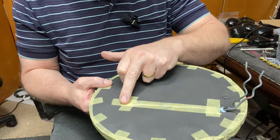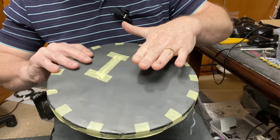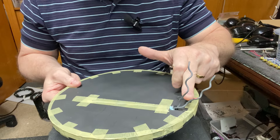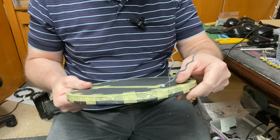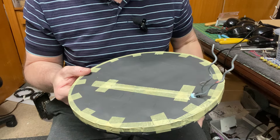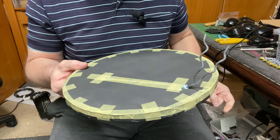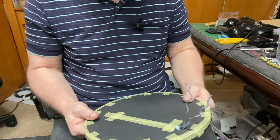Under the tape here is the grounding wire. The grounding wire has to be around 0.12 of a millimetre — make sure it's tin-plated, not nickel-plated. Don't put nickel near coils; it's ferrous. Just a tin-plated piece of copper wire. It basically joins the two sides and goes on to the outer braid for the transmit winding. Just a very fine single strand — it's not critical as long as it connects well. When you put it down and tape it, you can dab some carbon paint like Y-shield along the wire, then put the tape on and it will set down hard. You don't want it wiggling around or it'll make a noisy coil.